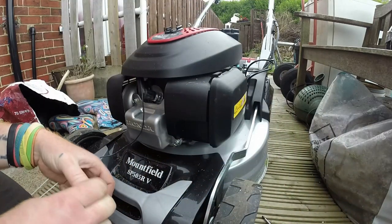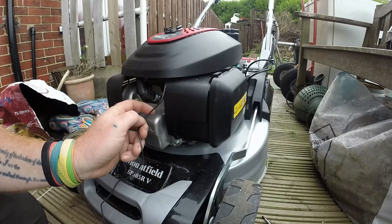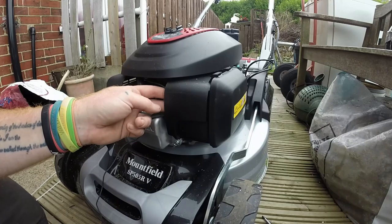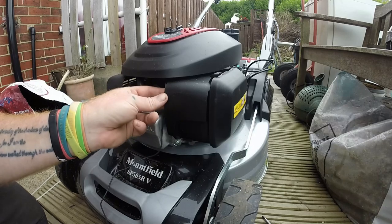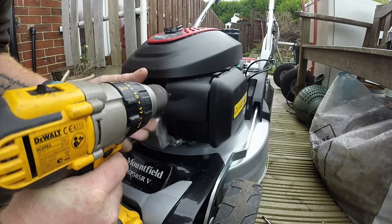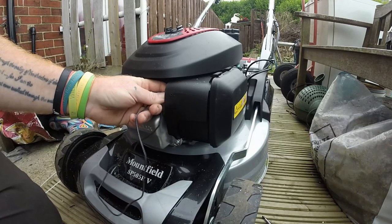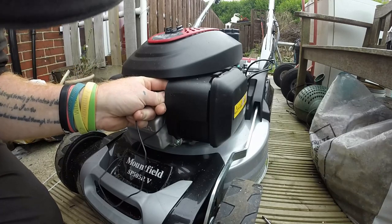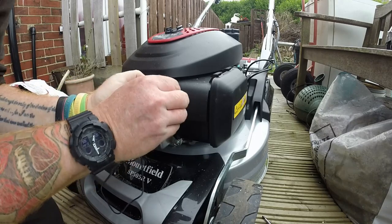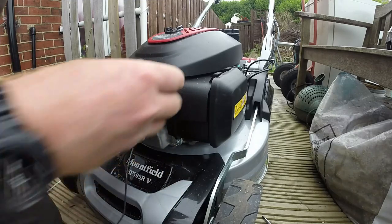Now you've got to decide where to place the module. If we didn't use these mowers day in day out and check the hours regularly, I would hide the hour meter in a less conspicuous place. But because we want to see it, use it and check it easily, I put it directly on the front. The only reason I drilled the hole is so there's no loose cable dangling across the engine, because you get interference then. You need to have the cable as tight as possible in the back of the unit and from the spark plug's HT lead.